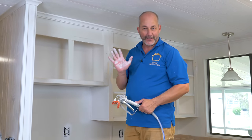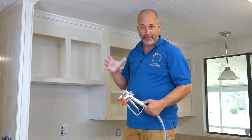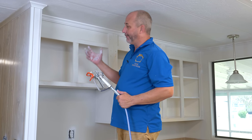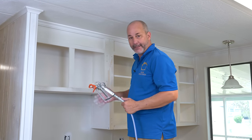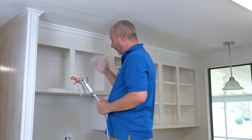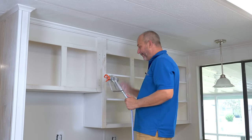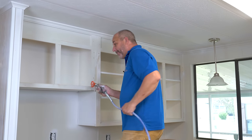This paint has a built-in sticky component so it bonds to surfaces and doesn't wash off that well — you might want to consider wearing gloves. Instead of masking off all the doors, I'm going to paint the entire thing. The secret is: hit the top, then the sides, then the back, and when I'm done all the back walls and ceilings of the shelves, come back and do the bottom and then the face — because we want to give the primer a chance to dry.